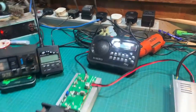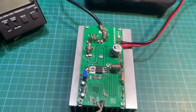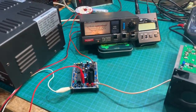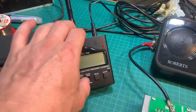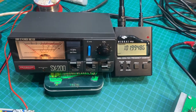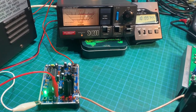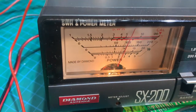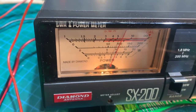Okay, so let's test our amplifier out. Let's get the amp plugged in first — red LED on, yep it's on. So the amp's on. Let's turn our transmitter on — we'll just wait for the green LED on here, and we should see our power go up on there. See what frequency we're around — and we're on. That's pretty much bang on 102 MHz. There we are, it's resonating at frequency, and we're pretty much bang on 100 watts there. Looking at the 200 watt scale — lovely.